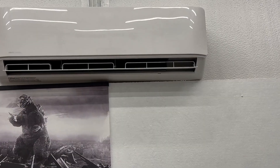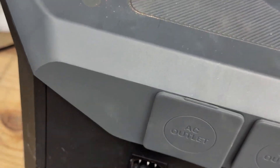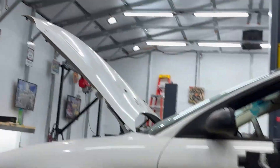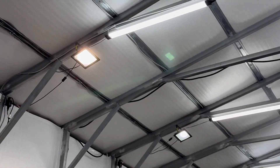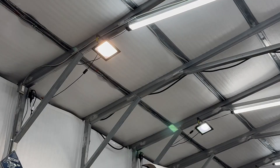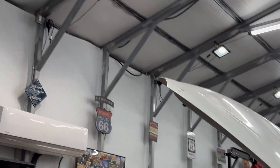Next we're going to turn off the AC and other loads, just leave the lights on, and see how well it lifts the car. Everything is off but the lights — pulling a little over 1,500 watts right now. Let's lift the same car on the same lift and watch the lights. It does have a slight voltage drop, but it is less than what the Solus puts out. So as far as maximum output, the 12,000 XP appears to have a little bit more headroom.